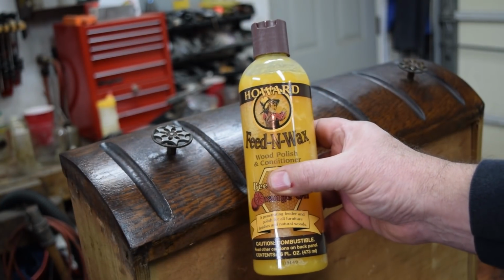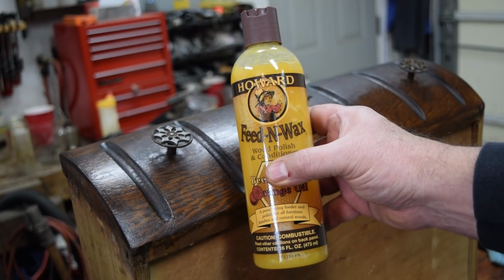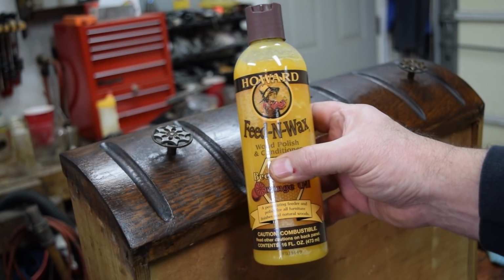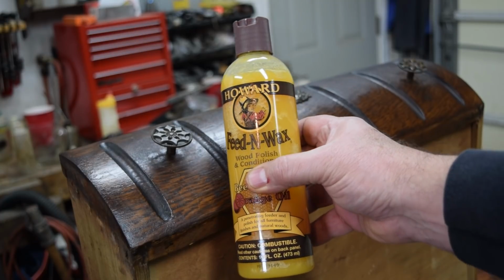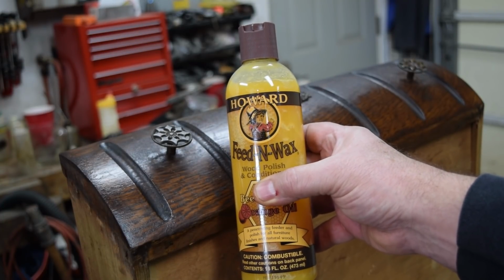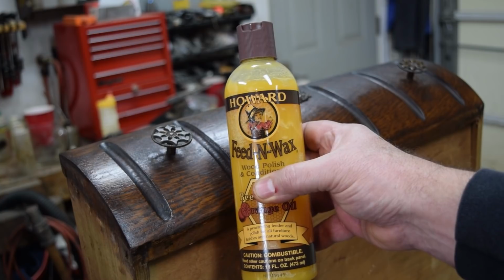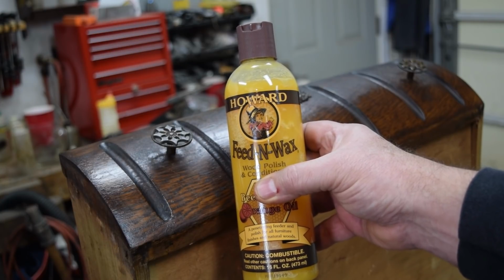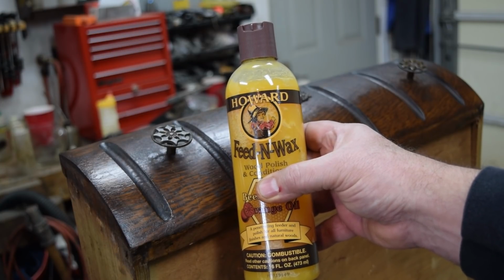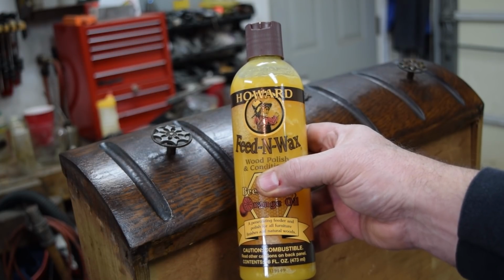This is the wax product that I use, Howard's Feed and Wax. Obviously they're not a sponsor, but I use it. It works well for me. When I'm dealing with a polyurethane or a lacquer finish, you know, a real thin coat and a real thin buff is all you need. Sometimes on old shellac finishes, they seem to need to have this lay on them for just a little while. I think the oil in it helps the old shellac, to be honest with you.